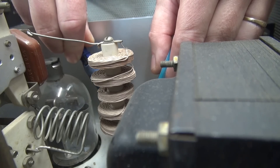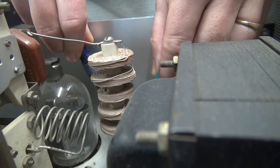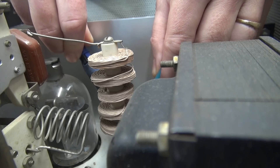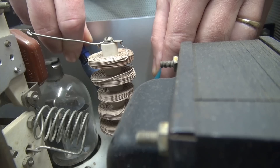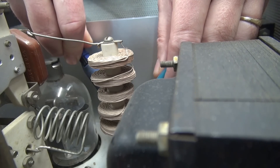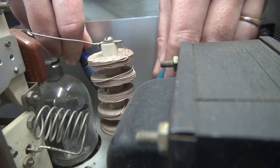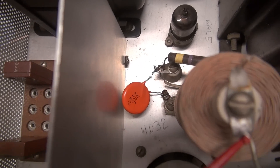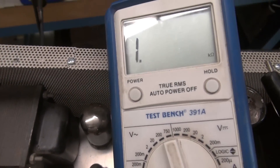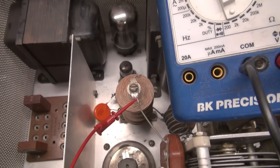Pull out the old wire leads and get the new cap in. I'm not going to fire this thing right up — I'll measure first to make sure there are no more shorts. There are also a couple caps underneath in the negative bias supply to the modulators and the output tube — the old original ones have to come out. The new orange cap is installed, no shorts. Now let's go underneath and change those two caps, then I'll bring this back up on the variac.